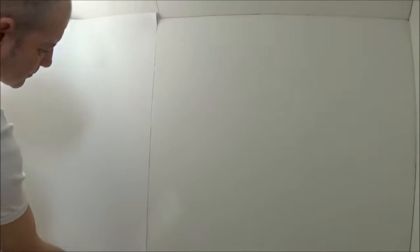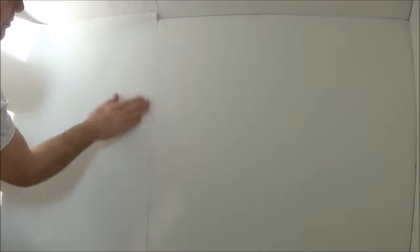When it comes to butting up the joints, just bend that paper, break its back a bit, and just keeping this edge less to move around. Also, what I've done is the adhesive, I pasted that edge. So I want to butt up, there's adhesive on this joint as well, so that'll fill in that gap, give it a nice tight seal there. And then, there you go.